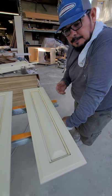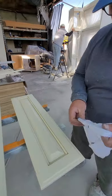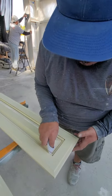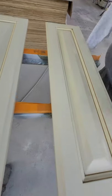The cabinets and molding are already all done. We'll probably let these set for about 30 to 45 minutes and let the patina dry, then we'll be able to apply a top coat. I have one dry rag here as well - if I see something that's a little bit heavy, I can come back and wipe it in and soften it up. And I'm going to grab our sample door.